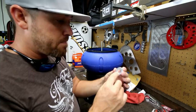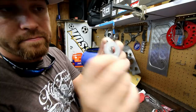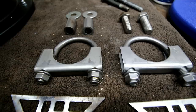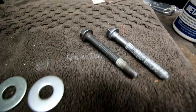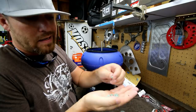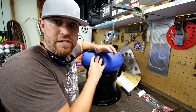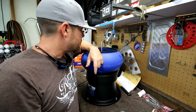There's the washer — it was a gold color before, some kind of coating that comes on these things, and you can see the green pyramids took that coating clean off. These little green pyramids get into all the nooks and crannies and clean really well. Apparently they kind of just deteriorate to nothing over time, so you keep adding media, and the machine has a port that disposes of dust as the media dissolves down.